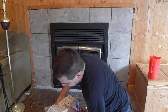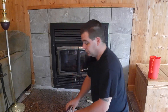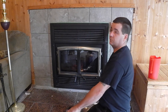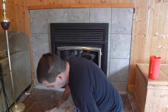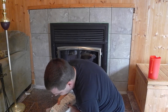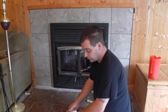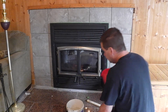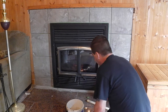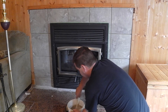I'm not going to need a whole lot. These come in little boxes because you only have these voids to fill, so you don't need near as much as mortar. I'm probably using too much here, but I don't want to have to do it twice. You mix it to roughly the consistency of peanut butter. You certainly don't want it runny at all when you're doing a wall application — you want it to stick right where you put it.